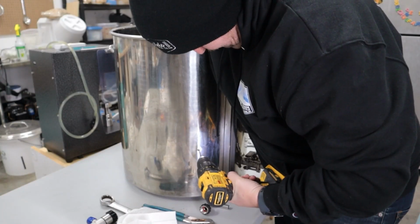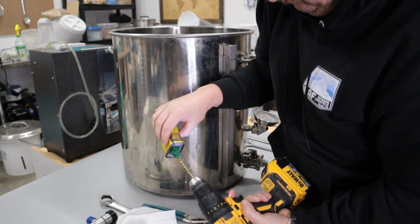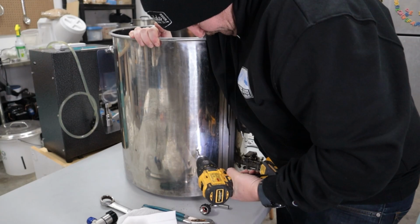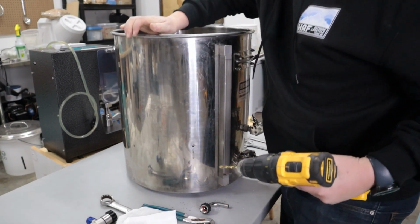Take your 3/16 drill bit and drill a pilot hole for your step drill bit. Don't be afraid of the cutting oil, it really helps. Unlike me, be sure to take all your attachments off of the pot and place any brewing equipment far away from your workspace. Metal filings don't taste great in beer, and for some reason your guts aren't designed for them.